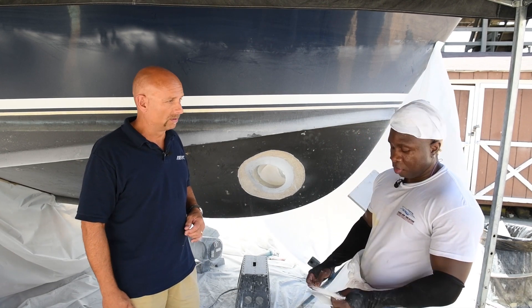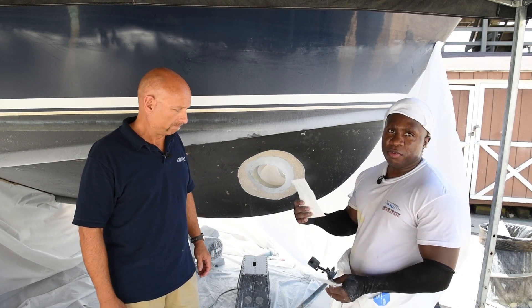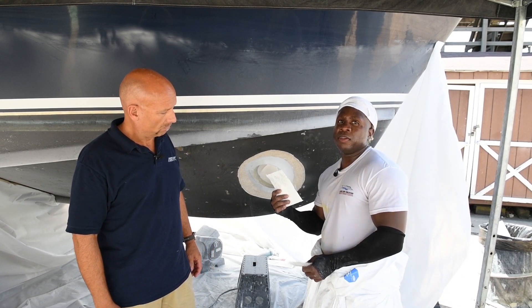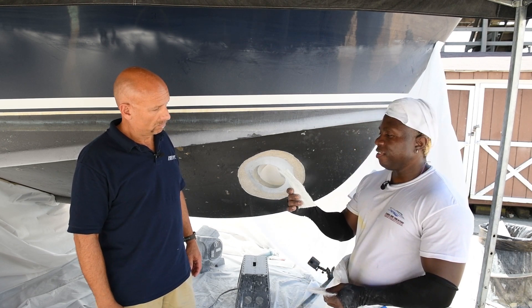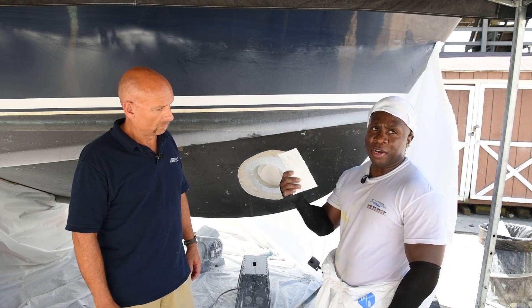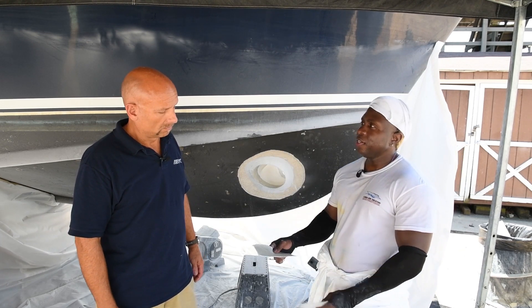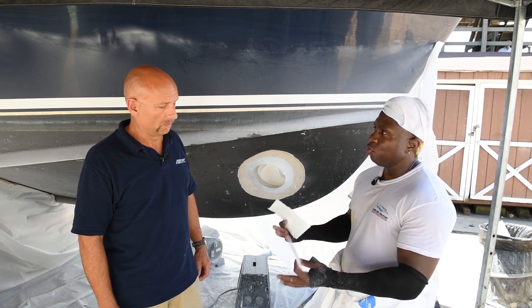Here's the material we're going to be using — polyester resin. This will be what goes on the inside. We'll go around the tube like three times with this. This is 1708, one of the more durable fiberglass mats you have. And then after this, we'll go with this one — this one just makes it look more pretty, more finished.